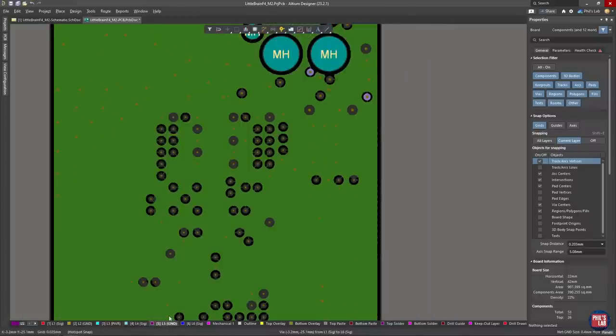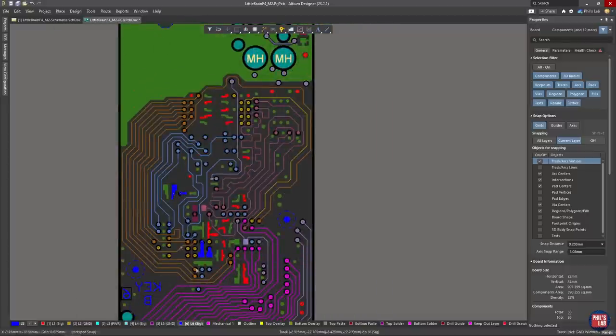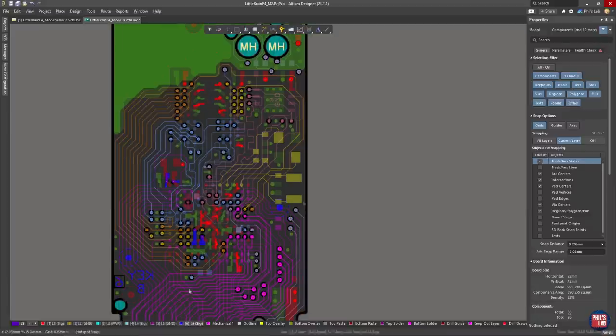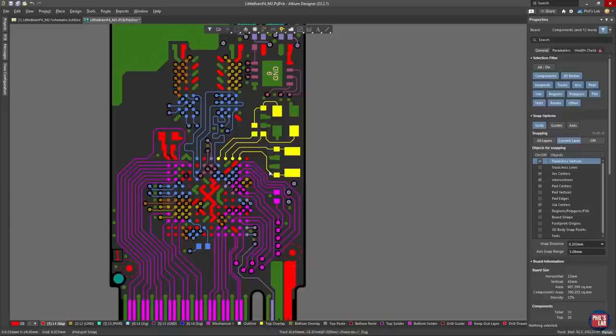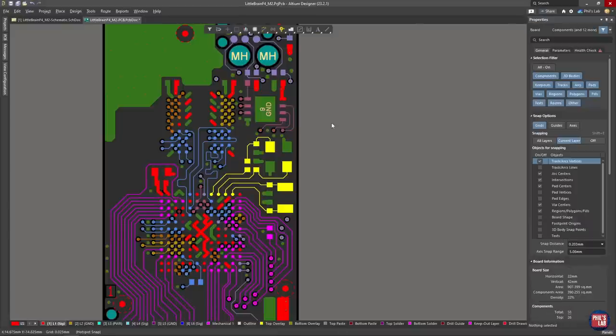The main challenges of this board are the size and fanning out these BGA packages. For this, I used a six-layer board at 0.8mm thickness. The layers are: top layer with most components; directly underneath, a solid ground plane; third layer is the power delivery layer with a 3.3V polygon from the card edge connector; layer 4 is the only internal signal layer, predominantly for SDRAM connections; layer 5 is again a solid ground plane; and layer 6 is the bottom layer, containing decoupling capacitors, some series resistors, and a lot of the IO routing.